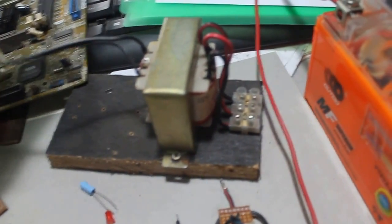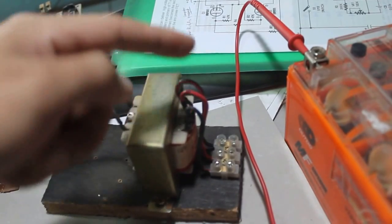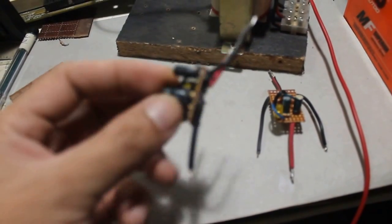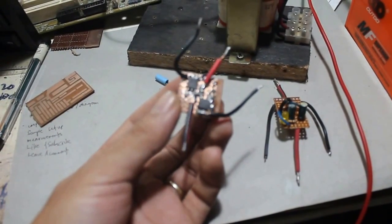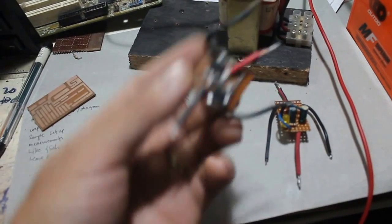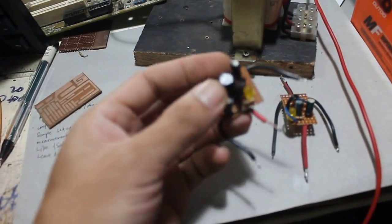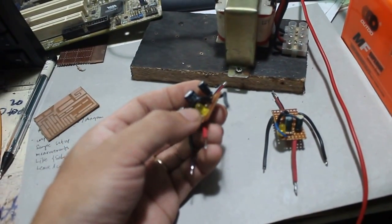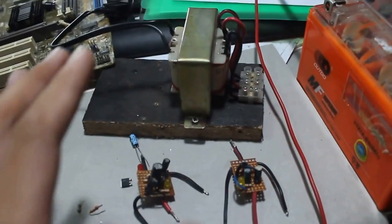If you want to plug it into the wall, you have a power supply that provides 12 volts, 0 volts, and 12 volts. I have a pre-made inverter here. It uses the two MOSFETs I collected, and following the diagram, I built this one. It consists of all the components I mentioned: the capacitors — I'm using the yellow LED here to indicate that it's powering. Let's hook it up and try powering this.